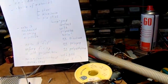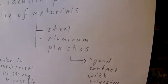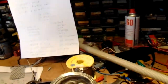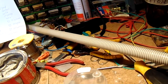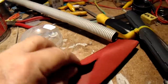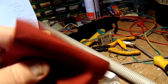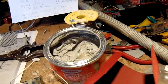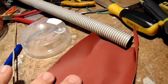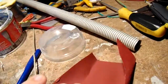Also about the bonding of polyester resin: it bonds to steel and aluminium, but not to all plastics. Here you see some plastics to which it bonds and does not bond. This is PVC cloth — it bonds because it's PVC, but this is flexible, so it will quickly break down when you move that piece of cloth.